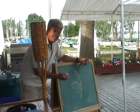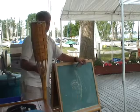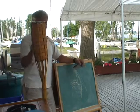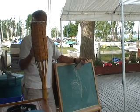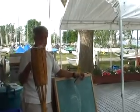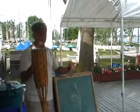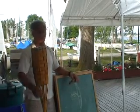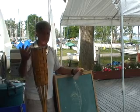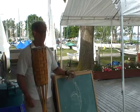In 4 knots of air, if your mast is too straight, your mainsail gets too deep, your jib halyard's probably pretty tight, and you can't get shape in the main. So you have to work around this magic number of 4 inches of mast bend. You have to artificially induce it in light air, and in heavy air you have to use the other things to keep it from bending too much. That's what those controls are all about, and you have to mess with them a little bit. I'm saying 4 inches of mast bend is the ideal amount. It's not always the ideal amount, but you always want some mast bend. I'm talking about upwind here.